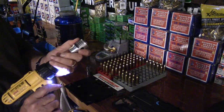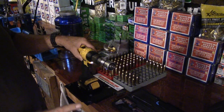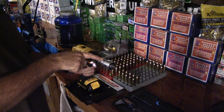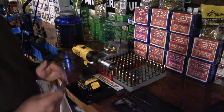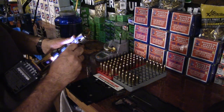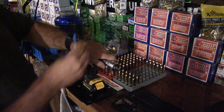We're going to go ahead and chuck this up. I leave a little bit of a gap — you can experiment at first. The first thing I do is clock it so that my set screw is up. This is how I loosen and tighten it: whether I'm tightening or loosening, I go to a consistent position and then just turn the drill.